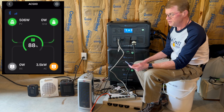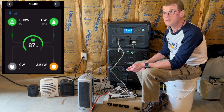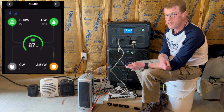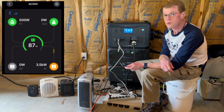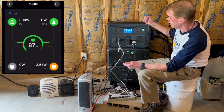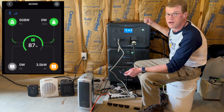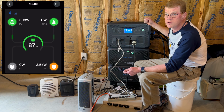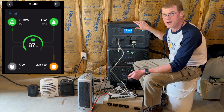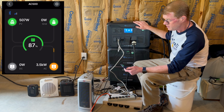Well, that's already more than the AC300 can do continuously, but if you've watched my other videos, you saw that in my very first house backfeed video with it, I overloaded it very substantially. I had it at 4,500 watts when I was running the microwave and the toaster, and it was still running my refrigerator and all that. And that was on the verge, according to the literature, of it shutting down. But it withstood it and it kept going. The AC500 is, according to the documentation, obviously 5,000 continuous. I believe it says 6,000 for 2 minutes, up to 7,500 watts for 60 seconds or 30 seconds or something like that. And then the ultimate surge rating, according to the documentation, is 10,000 watts for this beast of a machine. And I think that is for half a second. But yeah, let's see what we get.